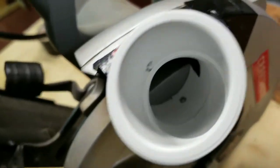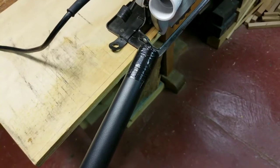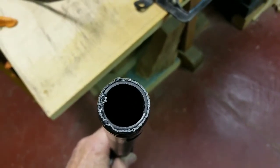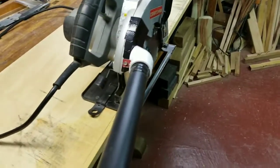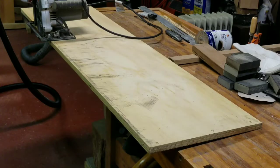One little change I need to make — that screw is protruding a bit, so I've got to file that down. We're just about ready to do our first test cut. The shop vac hose I'm using comes with an inch and an eighth outside diameter hose. I had to wrap some duct tape around that to make it fit in the inch and a quarter fitting, but that's nice and snug. I'll be doing this cut left-handed, so I'm going to be standing off to the right side of the saw. I have this hooked up to my whole shop vacuum system — it's not as strong as the normal shop vac, but let's see how it does.